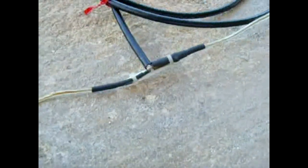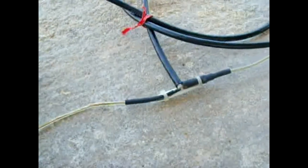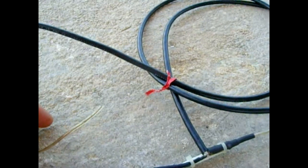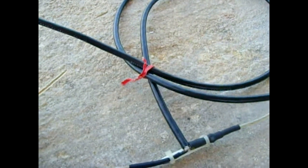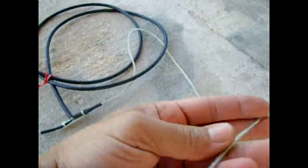I made this antenna a dipole. There's a calculator online called a dipole calculator. I'm running around 90.5 megahertz and that means the antenna is a little over 5 feet from tip of this side to the other tip there.